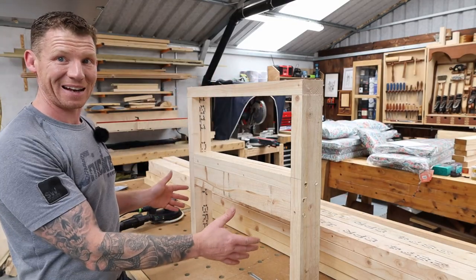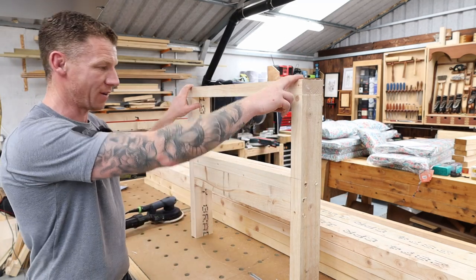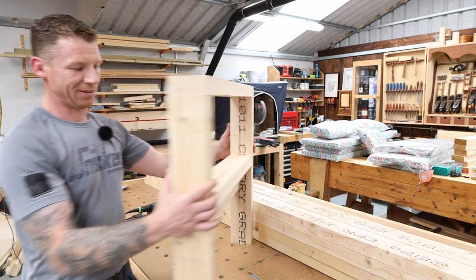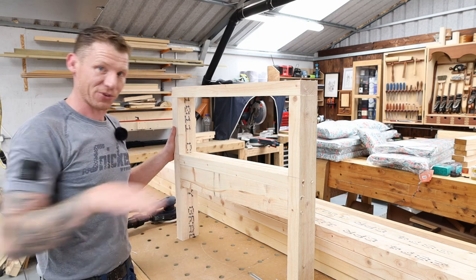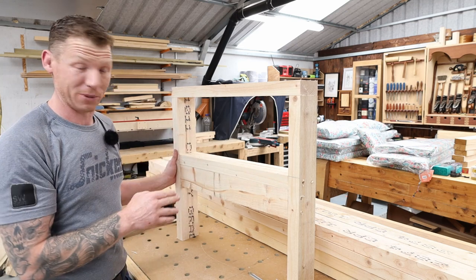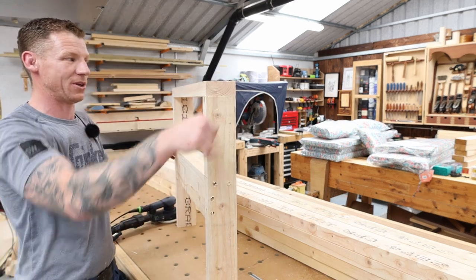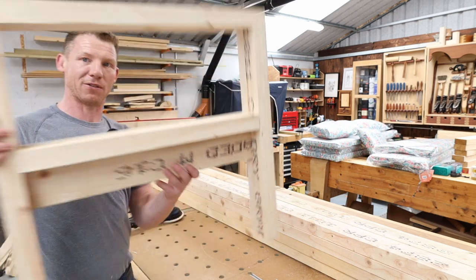The armrest and leg frame is assembled: a cross piece for the armrest, two uprights to 700mm, a piece at 400mm height, and a vertical brace in between. This sits flush on the inside and we'll fix the seat frame to it. All holes are drilled with a 12mm bit and I'll be plugging them, sanding off and painting — you won't see those screw holes. I've also run a chamfer or round-over bit around all edges to make sure there are no rough edges. Three of these frames in total to make.